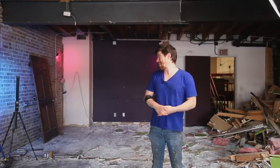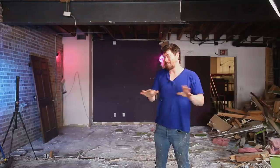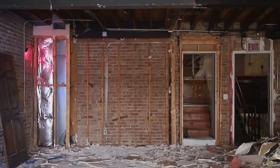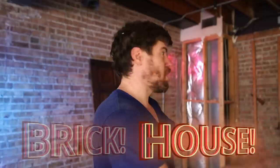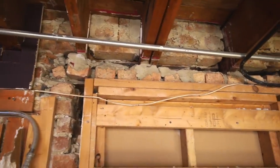The first thing we've got to do today is tear down this big wall behind me, which is between where the kitchen and master bath will go. We got some good news and some bad news when we open up this wall. First, the good news: obviously we got brick, and hopefully we can keep some of that in the new room design. Bad news is that some of the brick is absolutely crumbling and falling apart right above this door here. I'm no masonry guy, but it looks like there could be some structural integrity issues, which means we need to rip out the brick — maybe put a steel beam across there or just fill it in with new brick, which is expensive.